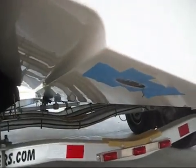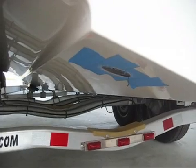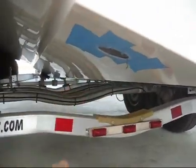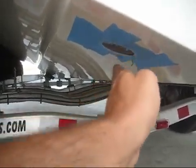where the deadrise is about 20 degrees on this boat. So we've chosen the 20-degree transducer so that the angle shoots straight down and not at an angle like this. Since it's a 20-degree transducer, all the guts of the transducer are angled so it shoots straight down.